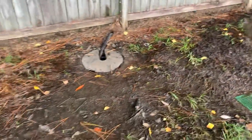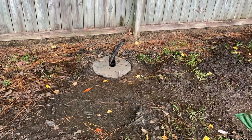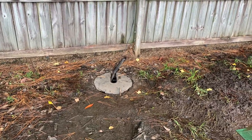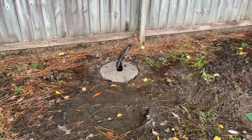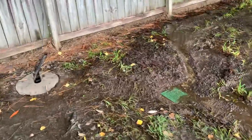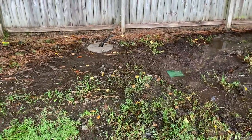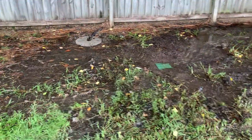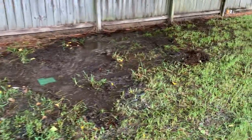Yesterday I tried hooking a garden hose to the setup to drain it to the street, but the garden hose diameter is too narrow and it clogs too easily with lawn debris like needles and leaves. So I had to go back to this black flexible hose. It's working well — I increased the pump from a third horsepower up to a half horsepower, and it drained this area in about an hour, which is much faster than usual.